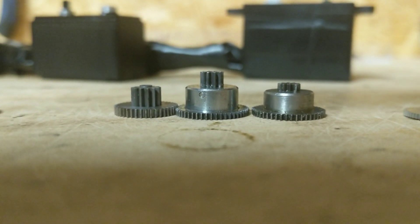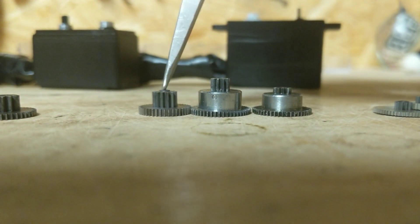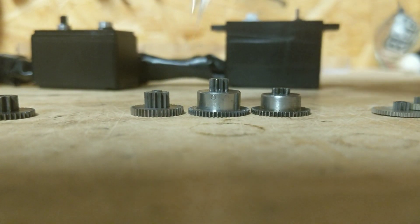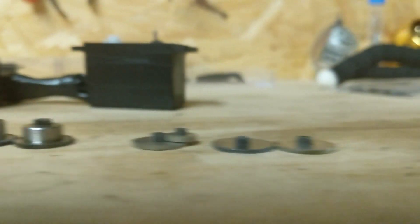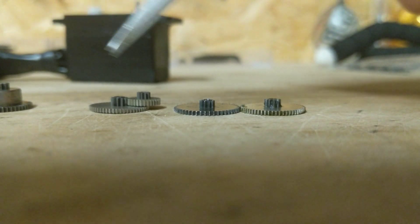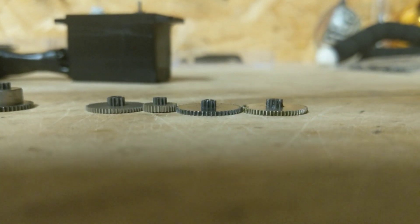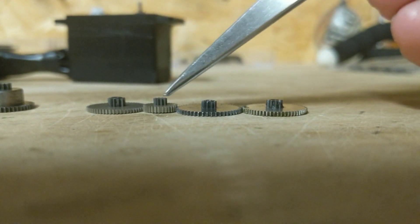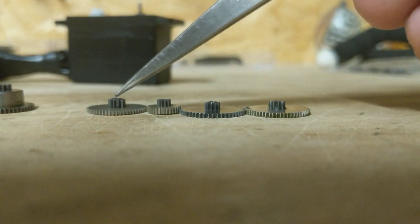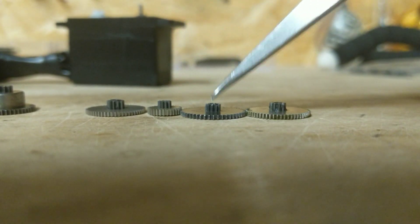Getting down to the next reduction, it's pretty clear to see that the Model T on the left is thicker on both halves of the compound gear. Down to the final reduction — mine has two more reductions left — but these gears don't really take much impact, they tend to hold up just fine. Even still, we have more meat. This is my first reduction and these are the other two servos' first reductions, and this is my second reduction — both of these gears are thicker than these two.